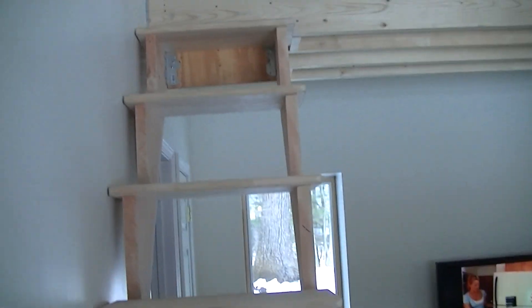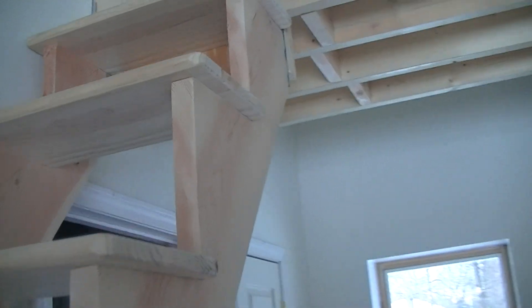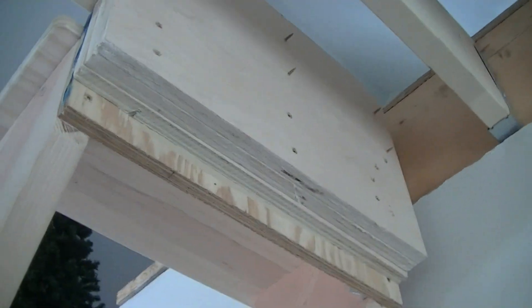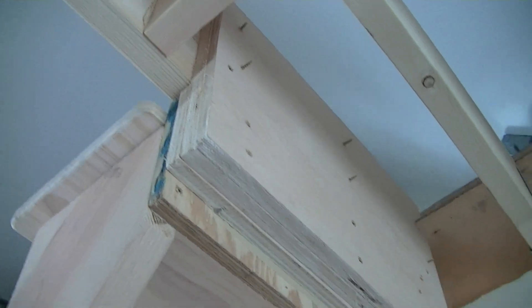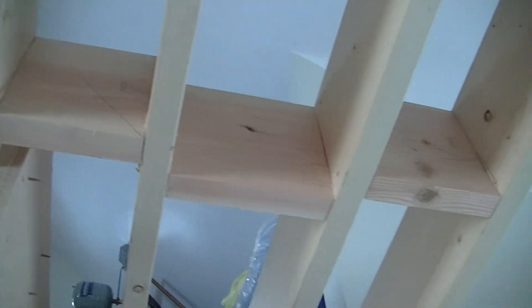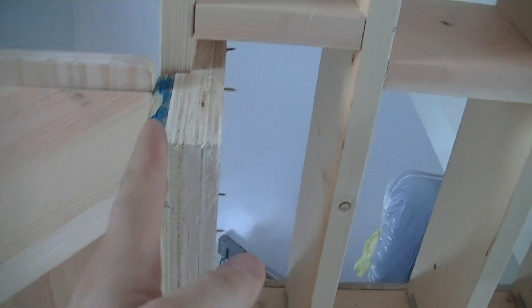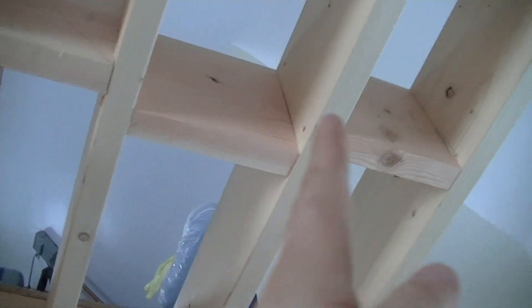Then we go up and I have angle brackets in there. I've got several layers of plywood all glued and screwed together, so it's hanging off the first joist. And then I added solid wood blocking with construction adhesive and screws, so that the weight load coming down on this joist will help transfer over to the other joist.